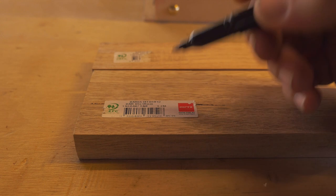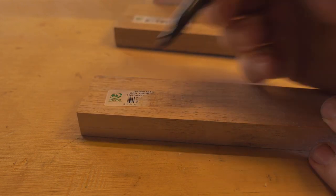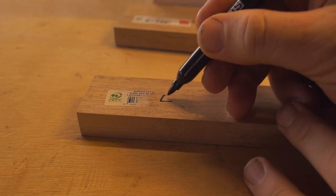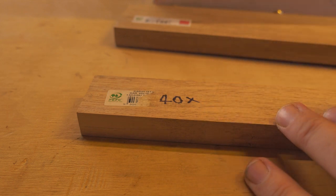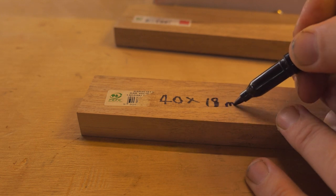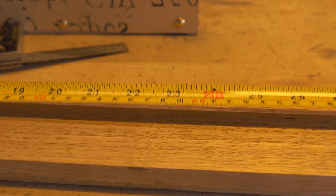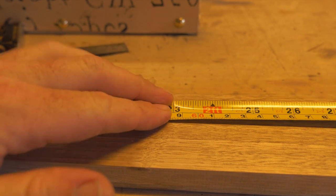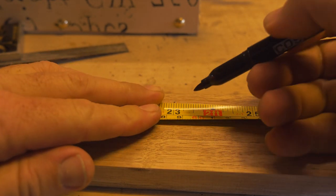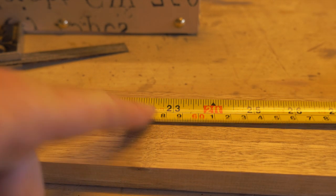So first of all, we've got two bits of hardwood. The sizing of them are 65 millimeters by 18 millimeters, and I've got a 1.2 meter strip of hardwood. The other one is 40 millimeters by 18 millimeters — a little bit narrower but still 1.2 meters in length. I'm using hardwood for the necks; you want it to be hardwood otherwise it will bend. The first measurement is going to be 23 inches in length, which is just shy of 59 centimeters.